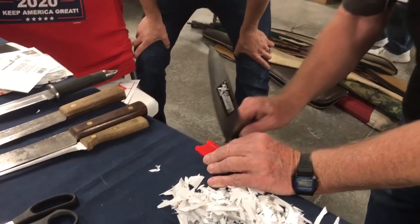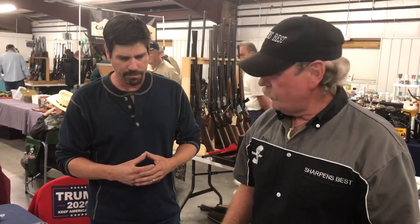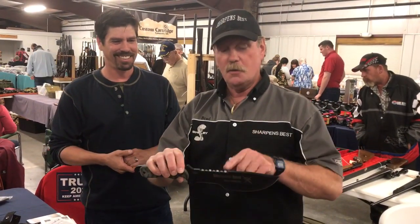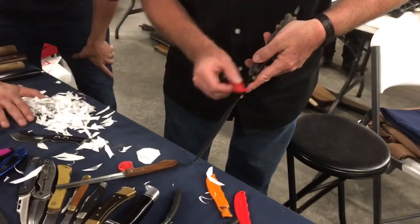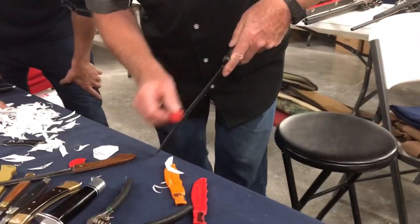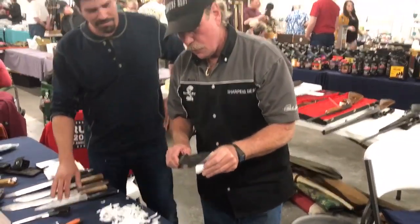I notice a lot of people have trouble with curved blades — inner curve and outer curve. Does that matter with your sharpening? No, it really doesn't. I'll show you a knife that really has a curved blade — that's a familiar knife. It was actually designed by E.J. Snyder from Discovery Channel. To sharpen something like that, I just take it like this, follow the contour of the blade, go right on around, right down through the round, and around this way. It's the simplest way to sharpen a knife like that. Then you do the other side basically the same way, and you end up with a knife that cuts like this.